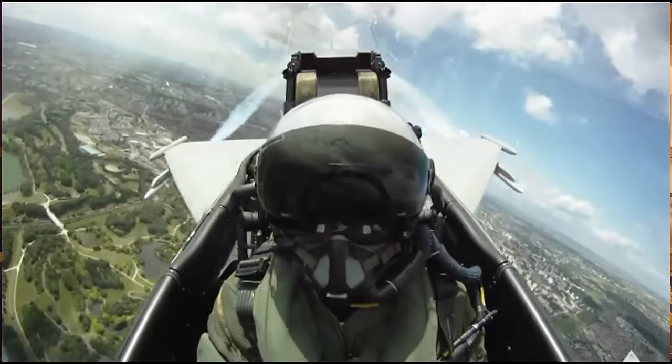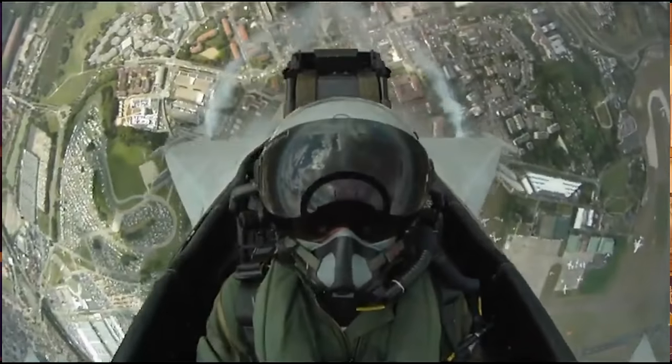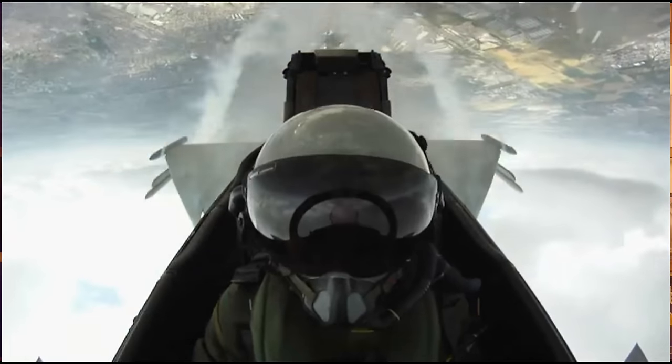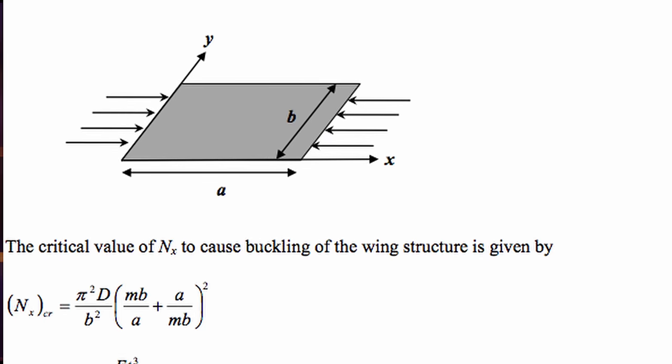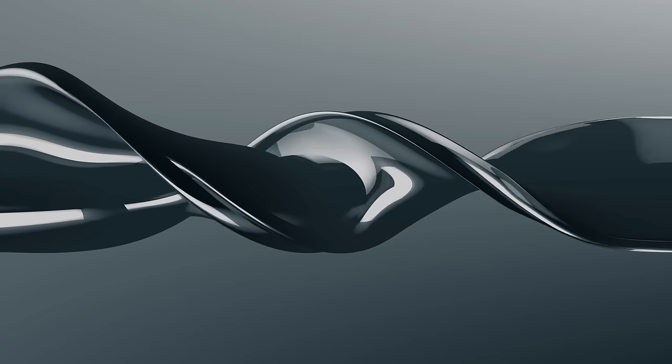Just adding extra material to stay on the safe side is okay with metals, but may not be of any use with composites, because it may not be capable of bearing that small stray stress that was unaccounted for during design — that stress may not be applied in the right direction. For example, a panel covering part of the wing or fuselage may easily bear traction stresses, but if it happens to be twisted by an unforeseen load, it may easily bend and break.